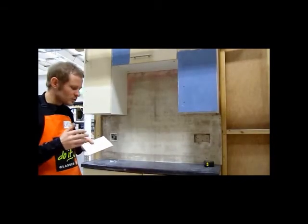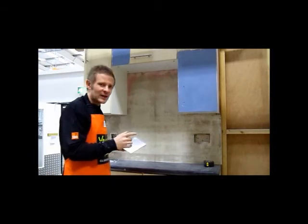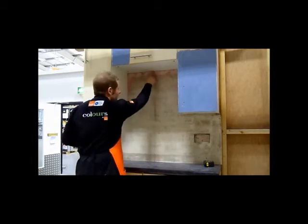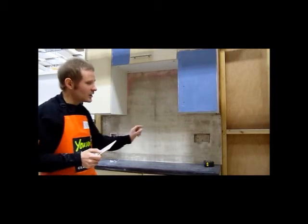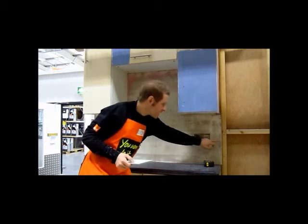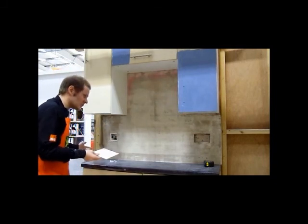What I'm going to do now is walk you through the process of how to actually lay the tiles to achieve a really professional finish. What I mean by a professional finish is this: we want to fit the tiles so that we have equal cuts around all the cabinets on either side, equal cuts top and bottom, and equal cuts at either end — so we have a symmetrical layout. In order to achieve a professional finish, we've always got to make sure that we don't have slivers of cuts — really narrow slivers — against any of the cabinets, or at either end, or top and bottom. Slivers don't look good aesthetically, they're very hard to cut, and they're very difficult to keep in place. One thing we cannot do when laying out the tiles is just pick any position on the wall, such as a left-hand corner.